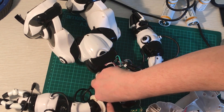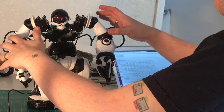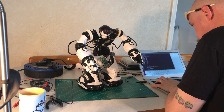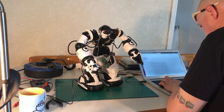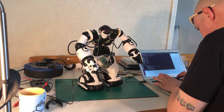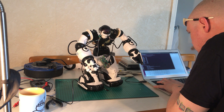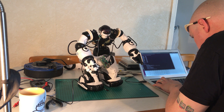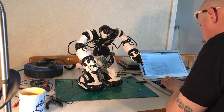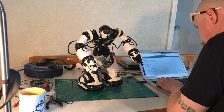After many, many repeated attempts to get it working, I got nowhere. The grunts I was getting sounded exactly like the grunts described online for how the version 1 RoboSapien should sound, so I was even more sure of my versioning — but the software was going nowhere. It was around this time that I decided I needed to change tactics and was taken to buy beer. While crossing the road on the way to the beer shop, I was suddenly hit by a stray thought: I bet I forgot to connect common ground. Because at this point, for debugging purposes, I had the Raspberry Pi Zero on a standard mains supply and Norman on his four D-type big torch battery cells — no common ground, no common communications. He wasn't seeing the responses, the pulses, the IR ticks.